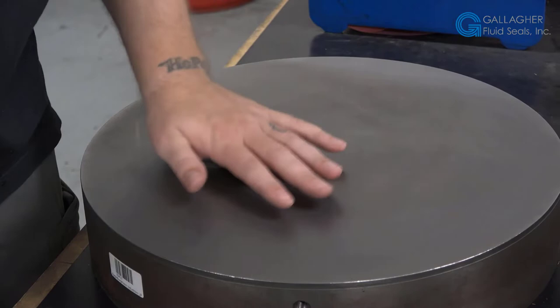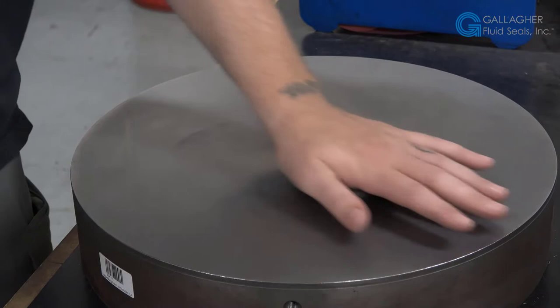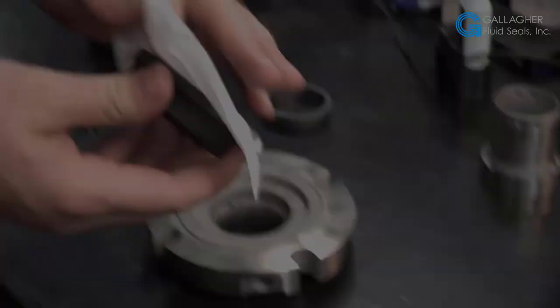It is very important, as this is where the secondary sealing element will sit. An important part of repairing hard faces, like silicon carbide, is measuring the part for tolerance. If the face is deeply grooved, it may not be repairable, as removing too much material will cause the face to be below tolerance, making it unusable.